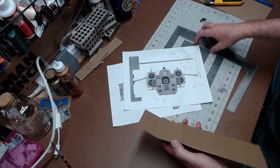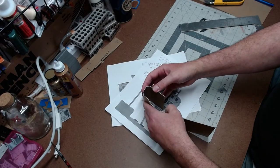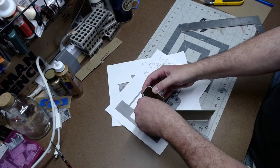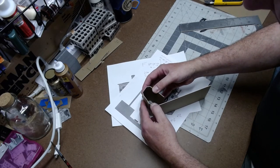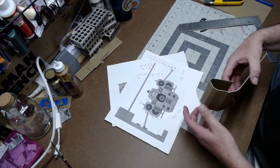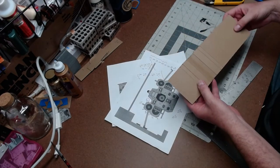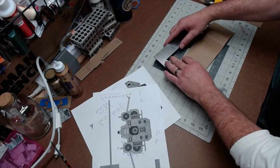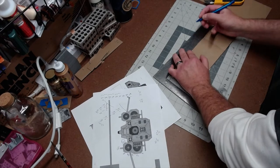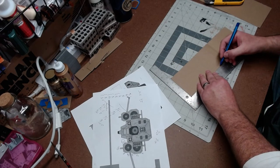Now we should start getting something that looks more like what I have here. Looking at it from above it's pretty cool how it follows it. Still haven't figured out how I'm going to force it to follow the lines, but I'll get there. The last one is just joining this to where it's a 90 degree cut and I think I measured it as one inch — let me verify that. Yeah, it was one inch. This last cut will be one inch from this line. I'm going to go one and an eighth just to give myself a little wiggle room for trimming and fine tuning.